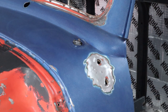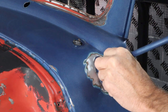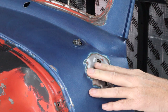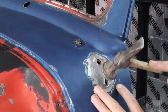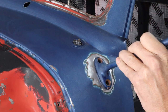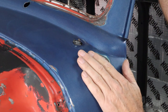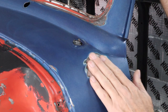Not perfect, but a lot better. We still have a little bit of low spot right there, but I'm not going to fret over that. It's a little high right here — I'm going to tap that down. Let's try the mirror on there and get it right over the holes. That looks really good right there — a little high right here in the middle, a little low where it bolts, but when it pulls together it's going to be just about right. There's a gasket that goes on here. So that's going to take a little bit of filling — very, very light. I'll use some metal-impregnated filler for this, and I'll do it on the patch panel on the other side too. That's done — let's move over to the hole.